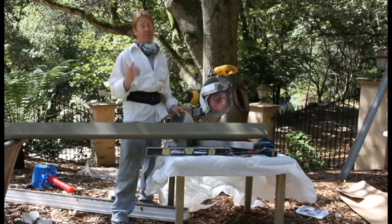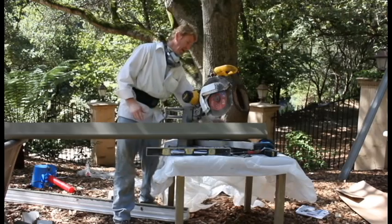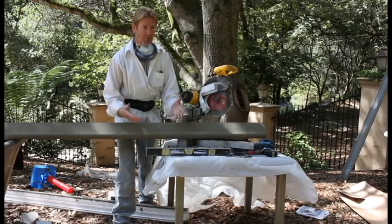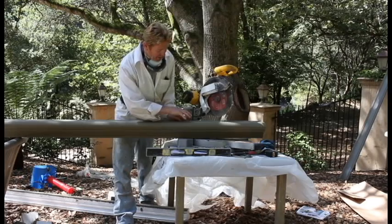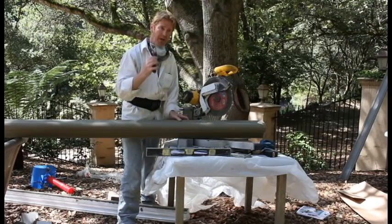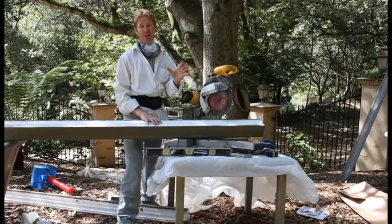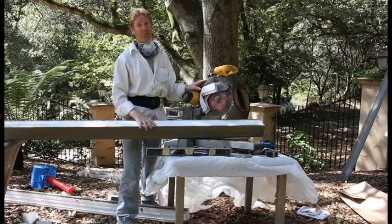Jason and I are going to cut these molds. I want to point out to you in case you try to do this stuff yourself — it's no joke. You take off your regular wood cutting blade and put a blade for metal or masonry. What it does is it won't shred these fibers, because these are cement coated and have fibers. I've done it where we've ordered molds with no fibers — it takes forever to put mesh and cement on them. If you're going to do it, order them pre-meshed and cemented. Another thing that's very important is have sharp blades, because if the blade doesn't go all the way through you need a sharp knife, and if you start having these little fibers come apart, it takes you forever to fix that. Always wear safety glasses and a mask — you don't want to inhale this stuff. This is about the most critical part of doing styrofoam molds: measure twice, three times, cut once, because if you screw it up you're going to have to order more.